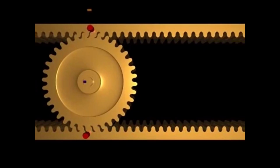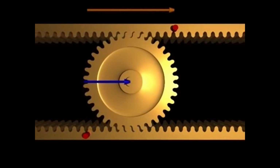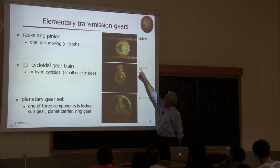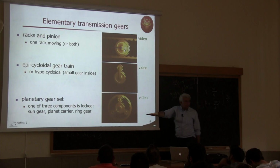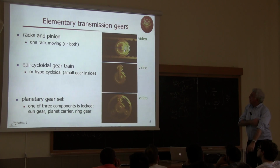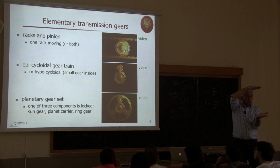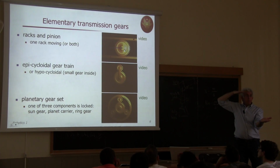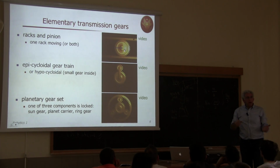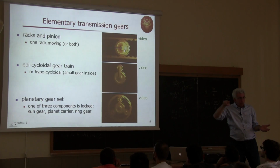you see one possible relative motion where you have some revolute motion which is transferred into a linear motion of the upper rack. In this case, the lower rack is held fixed. Okay? So you're rotating the wheel with their teeth engaged in the upper and lower rack. The lower rack is fixed and the upper rack is moved. This is not very convenient for a robot application. Why? Because you have seen that there is a translation of the axis, of the revolute axis of the wheel.